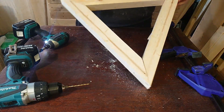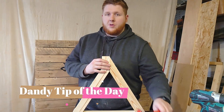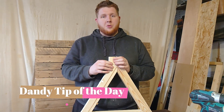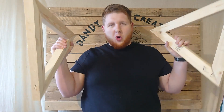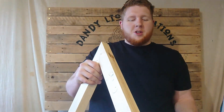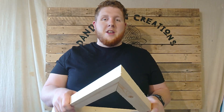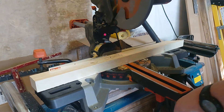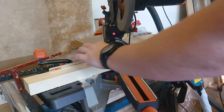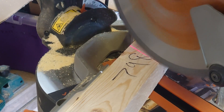We have a Dandelion first — a triangle! Dandy tip of the day: always save your off-cuts so you can use them when clamping. It makes it much easier to clamp on a 90-degree angle than on an angled surface. Got the two triangles done — that means the base and the top are both complete. Now moving on, let's create some supports. Once I've done that, I'm going to start drilling through, adding the tension lines, and then we should have — at least in theory — a floating chair. Stay tuned.